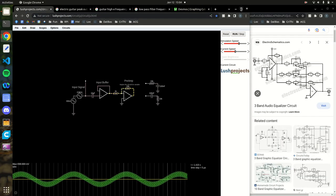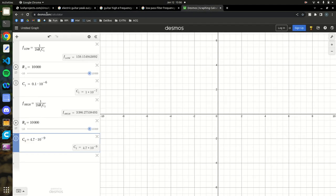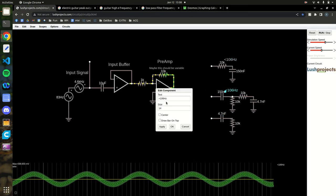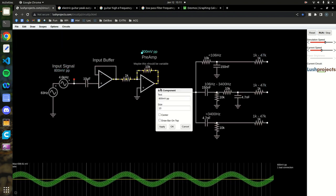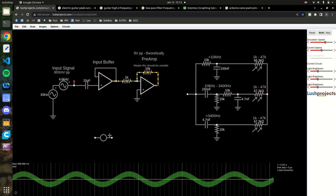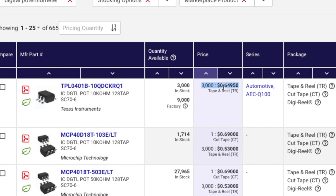So if I'm going to make a guitar pedal, I don't want it to be any basic analog pedal you could find for cheap. I want digital features, like the ability to store different settings and such. Now, as I do not know anything about discrete signal processing and audio programming, I'm going to avoid that whole mess. Instead, I'm going to make my own digital potentiometers for controlling an analog circuit. Essentially, I'm going to take an analog pedal, throw away the knobs, throw in a microcontroller, and call it a day. Now, why would I make my own digital potentiometers when I could just buy them? Well, have you looked at the price of those things? They're like $2 a piece, and that's way too much for me for a basic component.